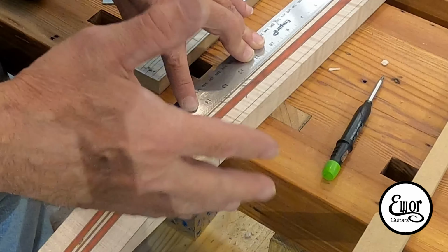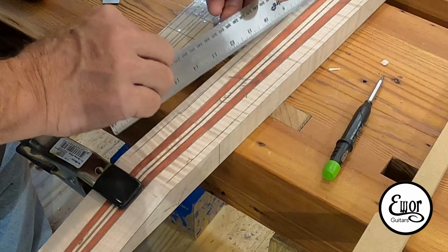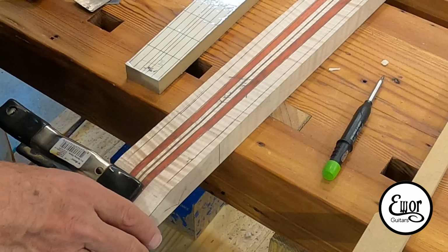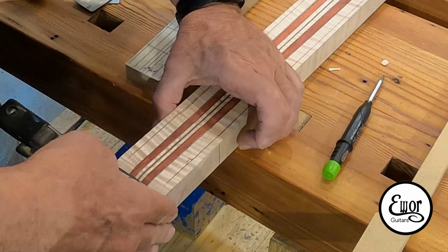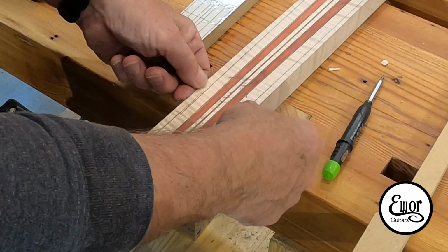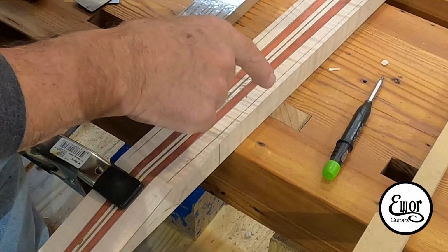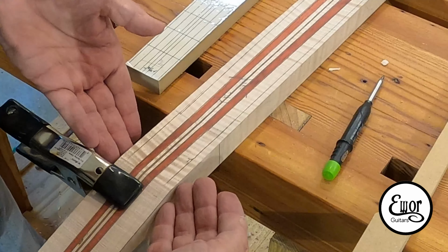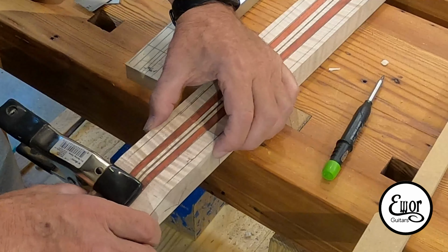So that must mean something to the effect of there was a slight little wiggle in the stripes going up the middle or something. So what I've determined to do is, rather than flushing the outside, since the neck itself has plenty of width, when I cut down based on the center line off of my neck template, I have plenty of width, so that's not a problem. I'm going to actually add to this the headstock part to get the width for the wings.